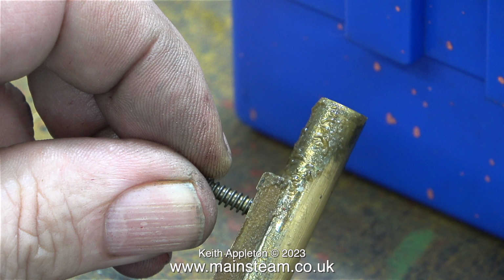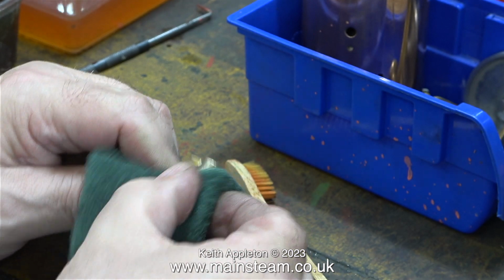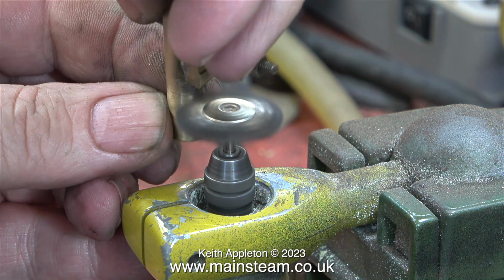Rebuilding small steam toys is a bit of a problem because almost always they are varnished. They are usually very old and the varnish is badly damaged. I find the best non-violent and safest method of removing varnish from old steam engines is to put the parts into a bath of cellulose thinners. And as I've shown many times, it also works for paint removal.